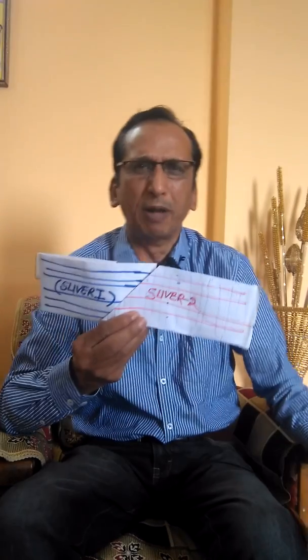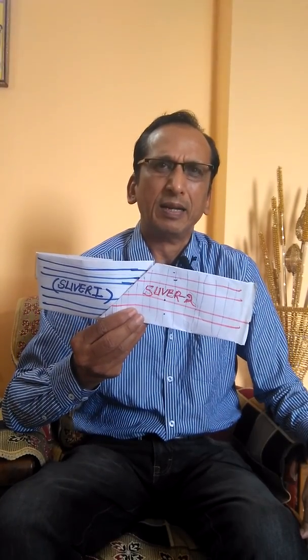Now friends, this is the problem: if the twist is given very hard, like this, then this twist is neither drafted and it will cause problems at the ring frame stage, these hard ends. This will again cause breakage at the speed frame.